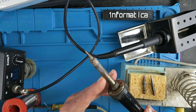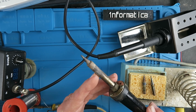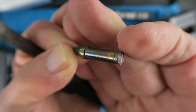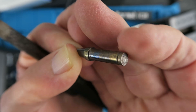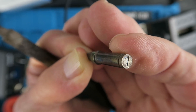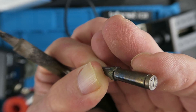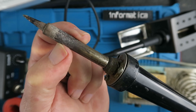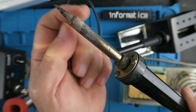Possibly not many people know that magnets when they're heated at a certain temperature lose their magnetism, and providing you don't exceed that temperature too much, as it cools down the magnetism comes back. You can just about make out on the end of the soldering iron tip here the little magnet, and it has embossed a number seven on it which means that this will switch at 700 degrees Fahrenheit which is around 370 degrees C. The magnet activates inside here a small magnetic thermostat which they cunningly called a magnostat, and that is the subject of one of the patents I believe.